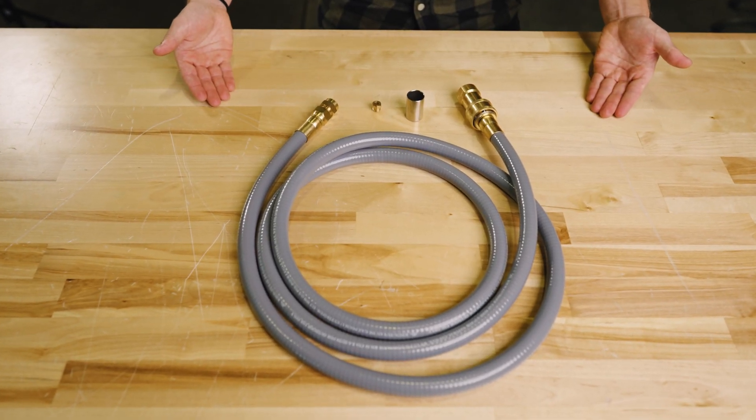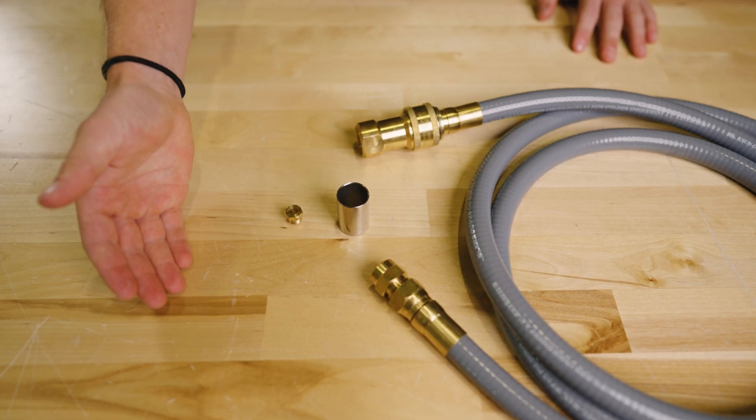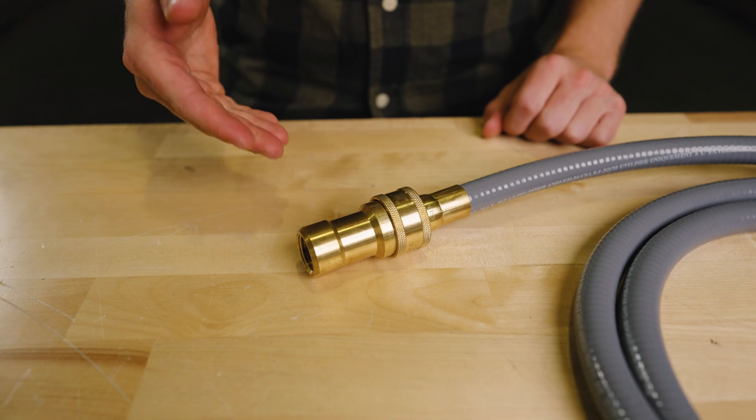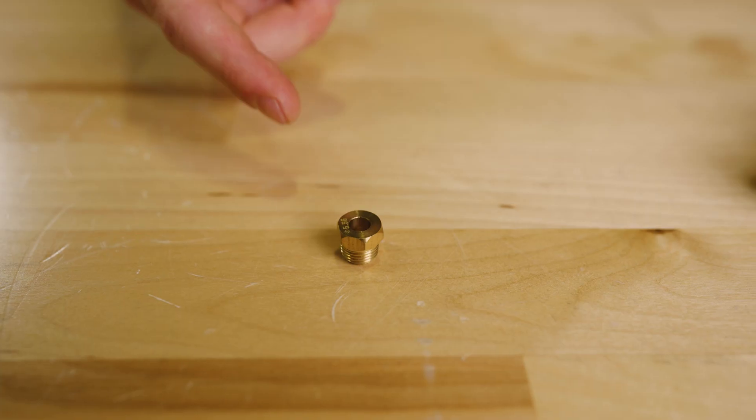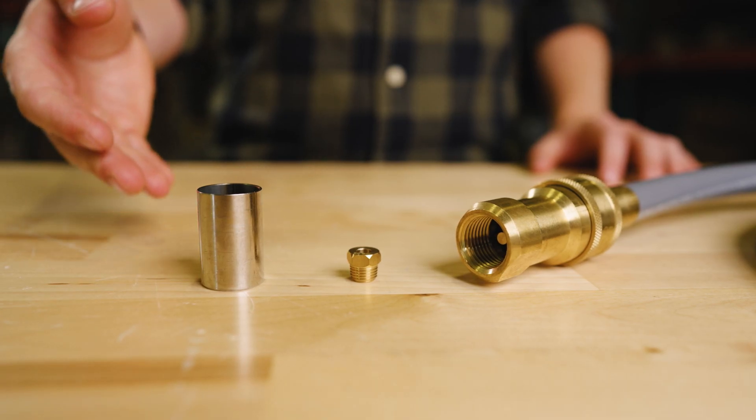The Celestial natural gas conversion kit includes everything you need to convert our CSA burners from propane to natural gas. It includes a hose with a quick connect, a natural gas orifice, and a sleeve to cover the propane air mixer. When purchasing the natural gas conversion kit, be sure you select the right size. The orifice in this conversion kit is sized according to BTUs and will need to match the BTU rating of the CSA burner you're converting. The conversion kit will include the hose assembly, a stainless steel sleeve, and an orifice.